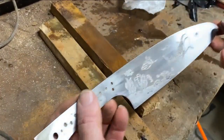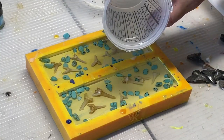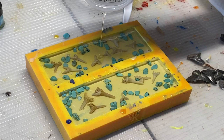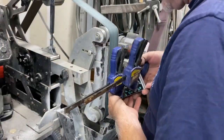In the previous video, I showed how we cast these fossil shark teeth into clear resin. The particular resin that I use is Total Boat Fix-Set resin. Because it's very thin, it takes a long time to harden, and therefore it gives plenty of time for the bubbles to reach the surface, so you don't end up with bubbles in your casting.